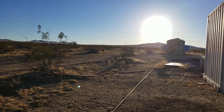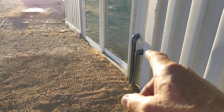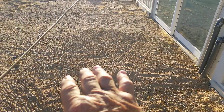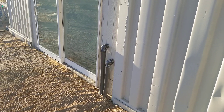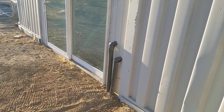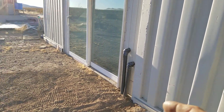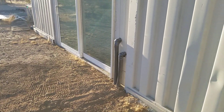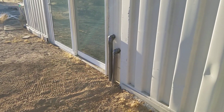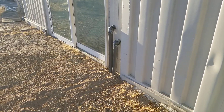Since I couldn't get anything done early, I started late. I got the wrappings on my two pipes, got it all backfilled and leveled over. I'll be building a box to hide those so I don't have to worry about birds and critters eating up the insulation or making nests with it. I'll pour a little concrete in the bottom of the box so if something tunnels under, it can't live in there.